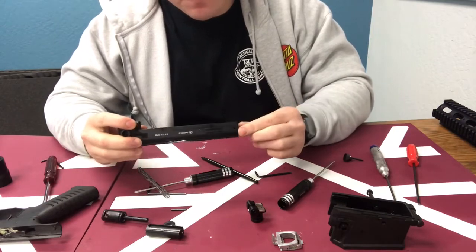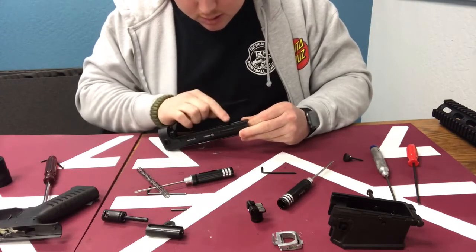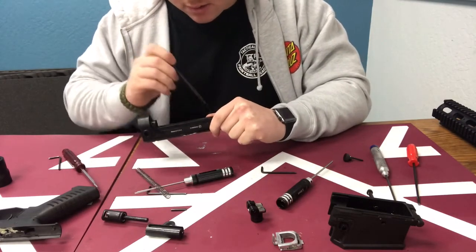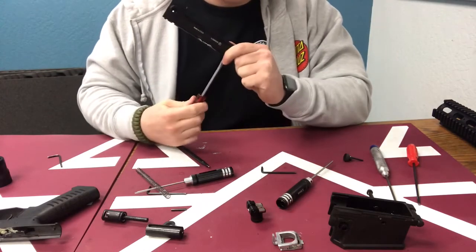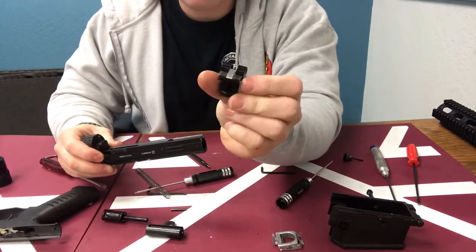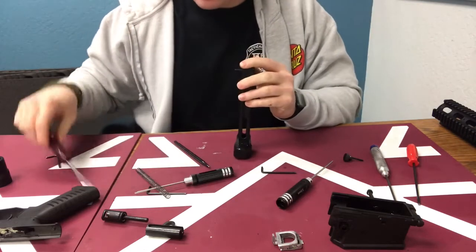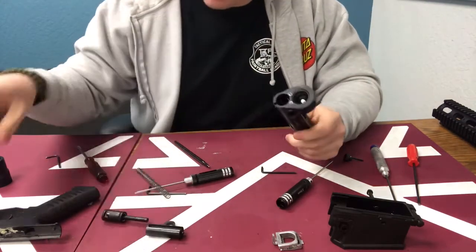Take your poppet assembly and put that back in. Go ahead and move our valve over just a little bit. Make sure that it goes over nice and straight. You don't want to lose your upper and lower receiver seal — I like to apply a little bit of super glue to one of the corners so that it holds. Poppet assembly's back in. Take your valve cover and make sure the leaf spring and the holes are facing down, push it in, then take your pin and put it in from the opposite knurling side. Tap it until it's nice and flush.